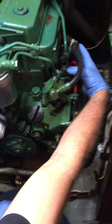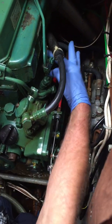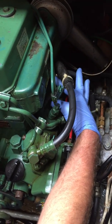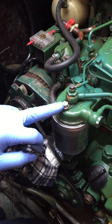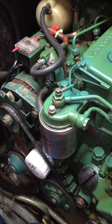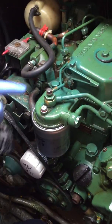Because it's two cylinder we've got two injection pumps down here. Now this banjo bolt here and this one way in the back were both slack, and I believe that to be where the air was coming from. That's the feed to the injection pump. We had nice clean fuel at the bleed nipple - those are the ones that were done and we actually broke one of those - see, that's been replaced. It's happened to everybody - it's a bloody expensive thing to replace.